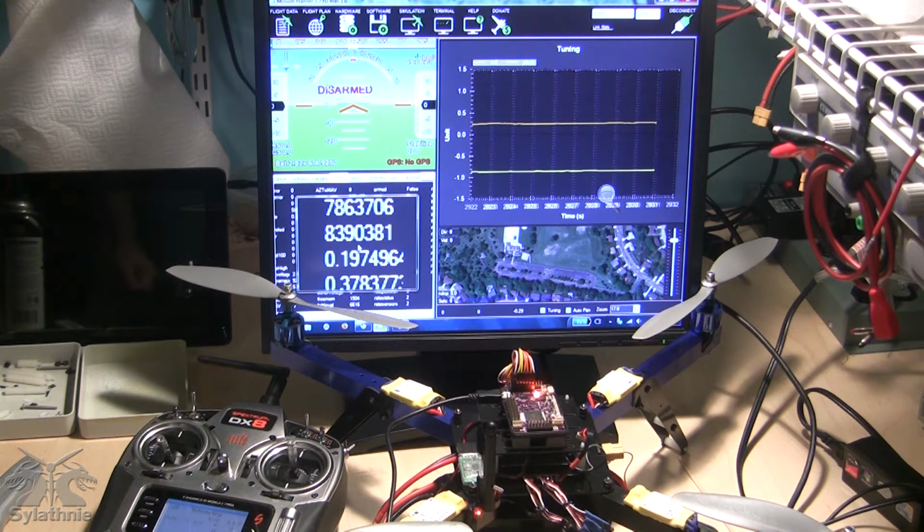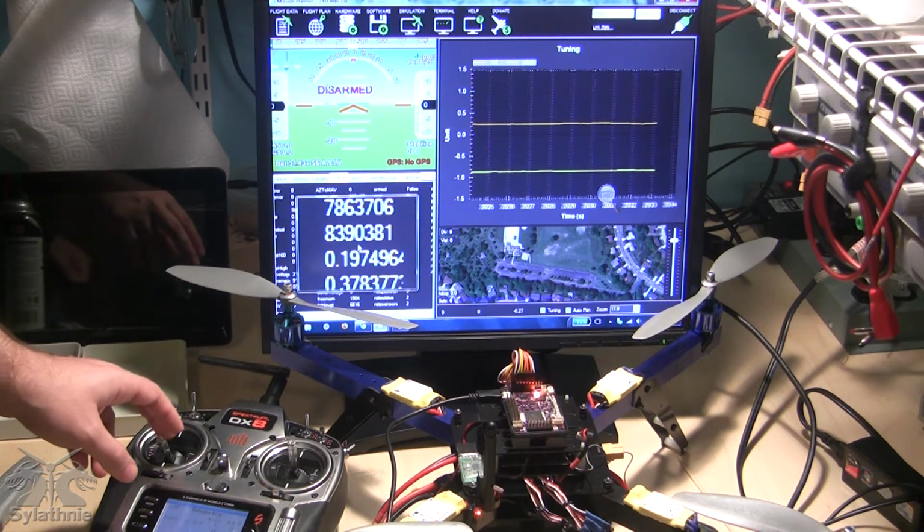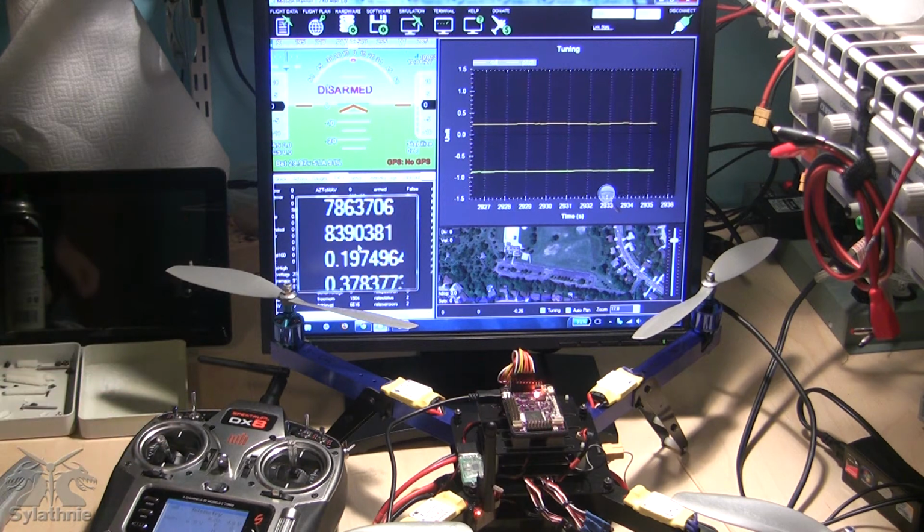After my first experiment, I wanted to do a little bit of testing as to how temperature affects the gyro while armed and disarmed. Last time I did disarmed, but I've noticed some big changes between how the APM behaves when it is armed and disarmed. So I'd like to do some additional heat testing while it is in the armed state.